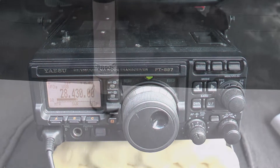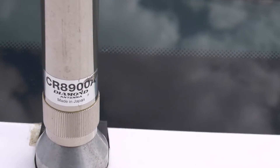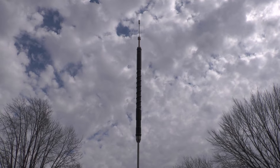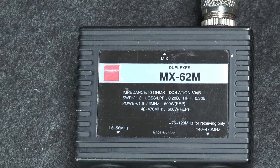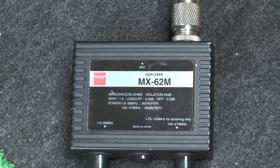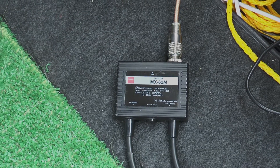This is the antenna I'm using on the car. It's a quad-band Diamond CR8900A which does 440, 2 meter, 6 meters, and 10 meters. And it works out pretty well and it's really good to have the tuner to go with it. This is the duplexer to split the HF frequencies off from the 2 meter and 440, so they can all be blended into the same antenna.